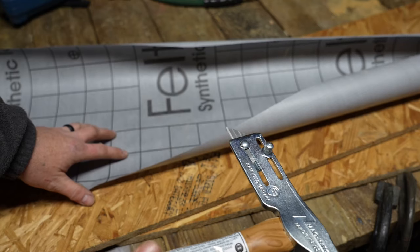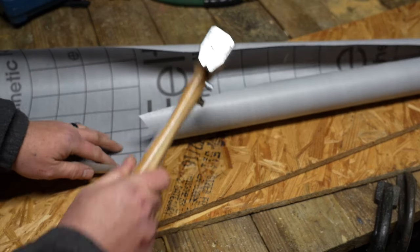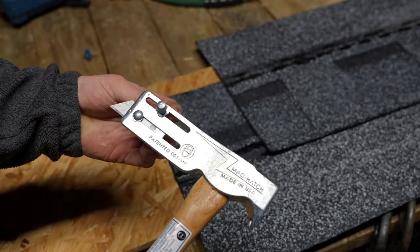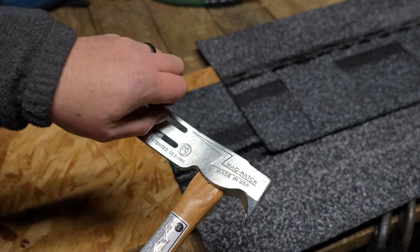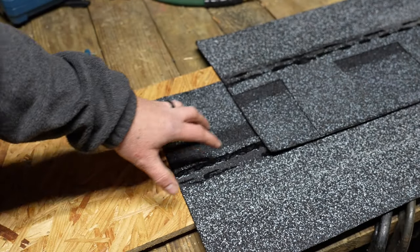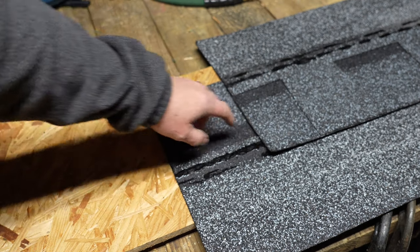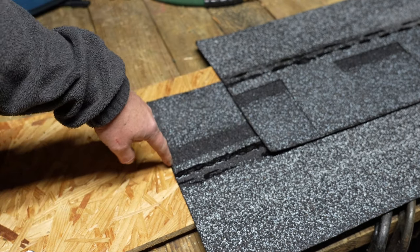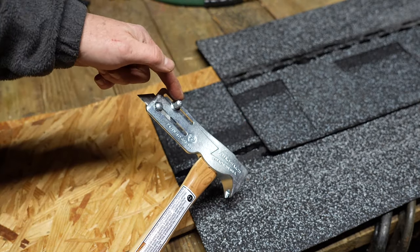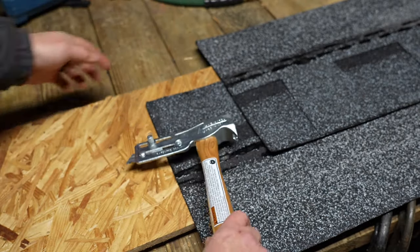And the built-in utility blade also makes it very easy to make some cuts and not have to carry a separate utility knife while you're on the roof. The adjustable gauge is also a useful tool when you're trying to figure out how to space the next row of shingles. In this particular example, the manufacturer of these shingles recommends that you step them 6 inches apart. So that means the distance between the edge of this row and the next set of shingles needs to be 6 inches. Presetting your gauge to 6 inches from here to here will allow you to very quickly adjust that